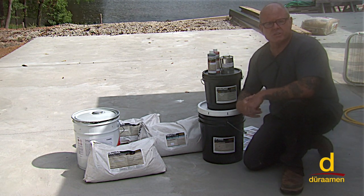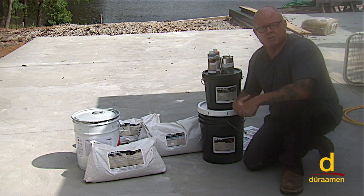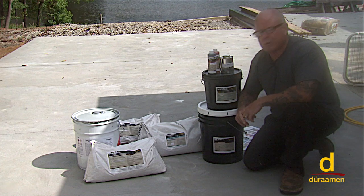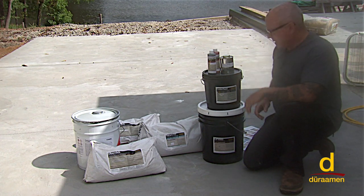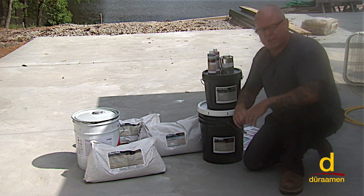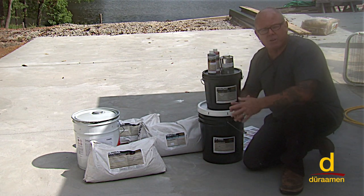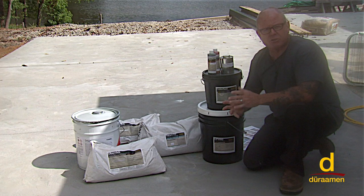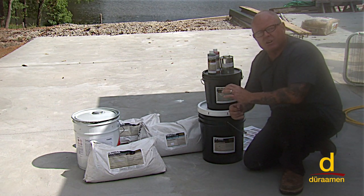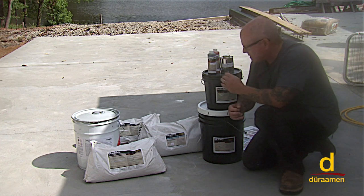In this video series, we're going to be talking about and ultimately showing you the Uberdek system, which is an exterior concrete resurfacing system. As part of the system, we have Param FP, which is their feather patch. So for example, if your concrete substrate had some chips, gouges, spalls, divots, we would go in and start by fixing all of those depressions with the FP system.